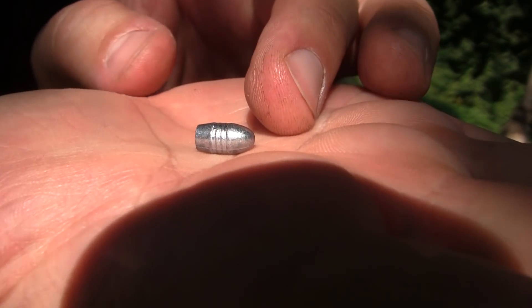The last band is slightly bigger to touch the lands in the barrel. Very importantly, you can see that the edge of the boattail is sharp — that means the temperatures were correct in order to fully fill the mold when you cast it, so this is what a perfect slug looks like. Also, one of the reasons I'm not showing the 25 caliber pellets yet is that I'm hoping the Huben K1 in 25 will be out soon — I believe in the US it already is — so I want to show those pellets on a 25 caliber K1.